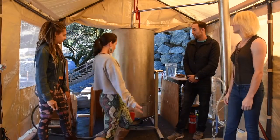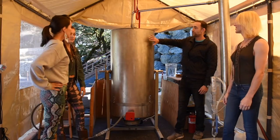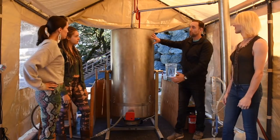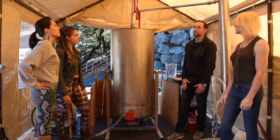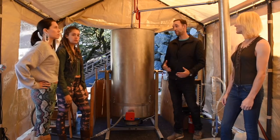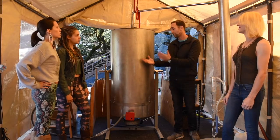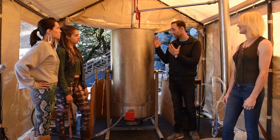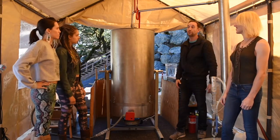Take a step back and check it out. We've got a 100-liter steam distillation machine. We're taking this from the traditional essential oil industry and loading it up with cannabis. We're here in Southern Humboldt and we have access to all these organic farms, so we're loading this thing up with pesticide-free material and running steam through it to pull off the terpenes.